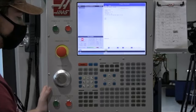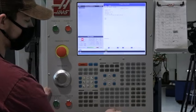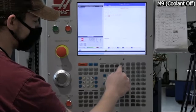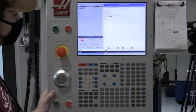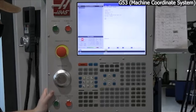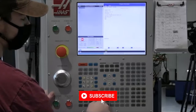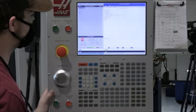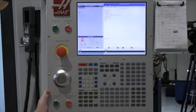After that we need to Z up. We go back to G00, G90 to put our control back in absolute mode, and take Z up one inch above the part. Cut our cooling off with M9. We don't use G28 — we like to use G53 because it gives us control of a single axis. So we go G00, G53, Z0, which references machine coordinates and takes the spindle home. Then G00, G53, Y0, which brings the table to the door because this is a VF4SS — a large machine — and we don't want to reach in to get the part. Then we end the program with M30.